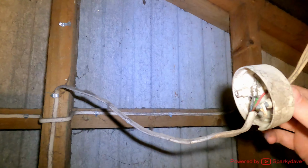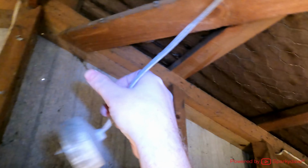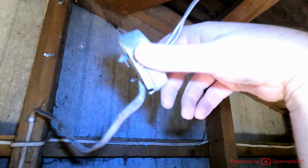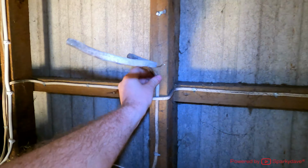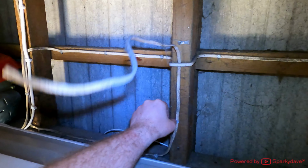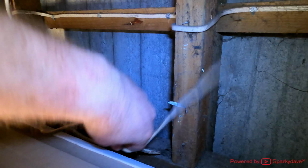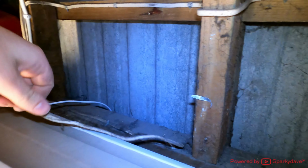Alright, cool. Looks like there's a cable here already for it from the light switch. I can just disconnect this light and use the existing cable to connect up to the driver. Well, this cable here, I'm just going to take the pin clips off it and move it down to where the strip light cable has come through. It's a bit filthy up here, to be fair. I'll wipe that down with a rag.